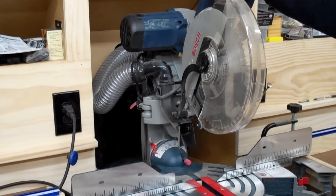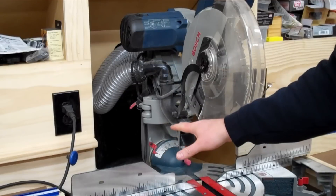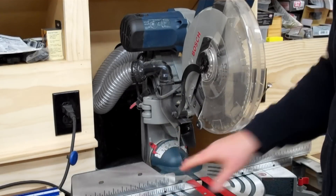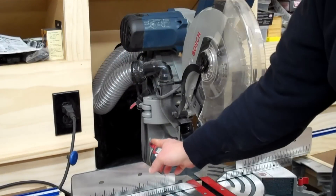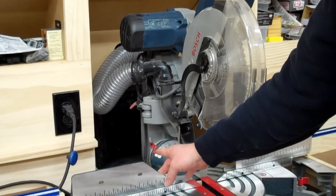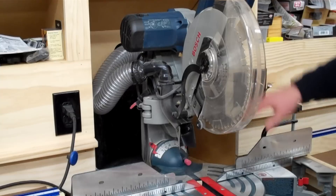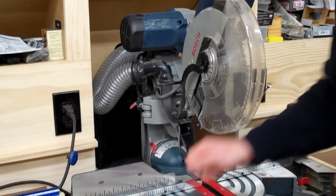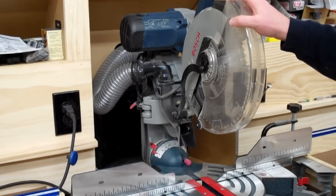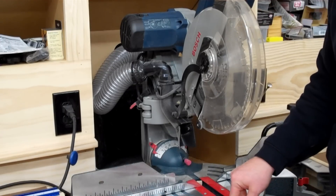The new wood shop has several different dust collection setups. Here at the miter saw station, I'm using a combination of a hose hooked up to the miter saw and also a very large hood in the back that's hooked up to a 4-inch line. At the miter saw, it's set up so that I've got a blast gate down below the bench hooked up to an auxiliary fence that I can just open or close, depending on whether or not I'm using it. Works really well — I'm probably collecting 90% of the dust at this workstation.